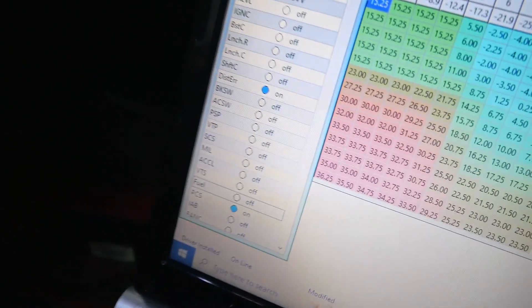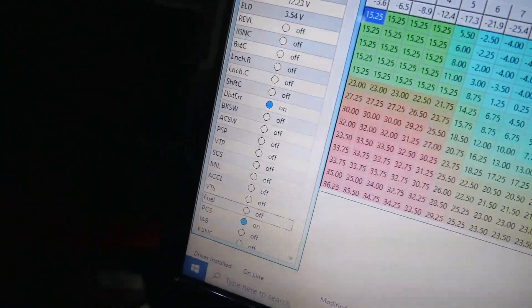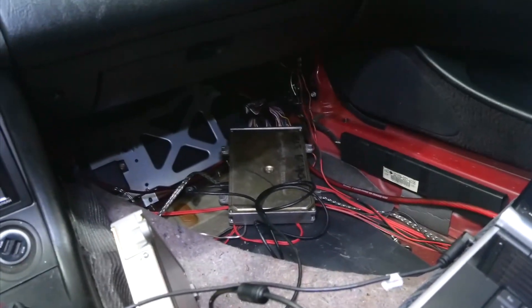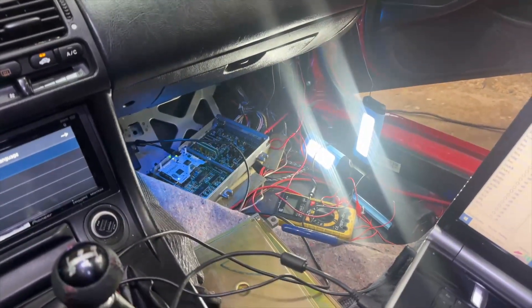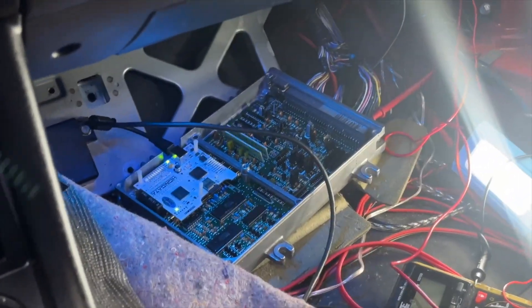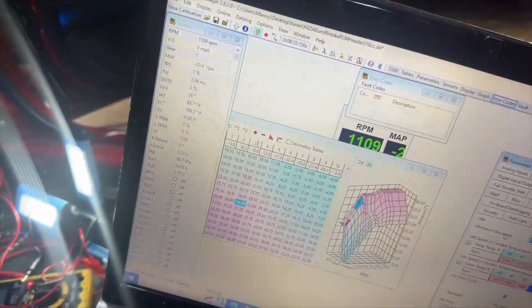The recap did not do it and I'm literally stuck on this distributor error. The fuel pump isn't coming on — it's got me nervous about this ECU. I finally got the car to run after so many days. What I did was I cut pin A7 on the ECU and grounded that out to the door right there — that grounds out the relay so the fuel pump can kick on. And look at that, it's running!